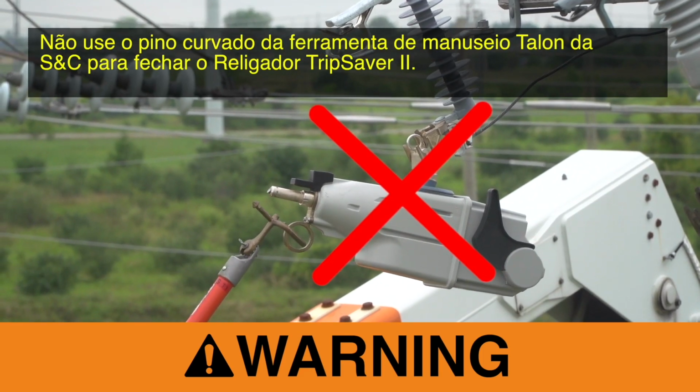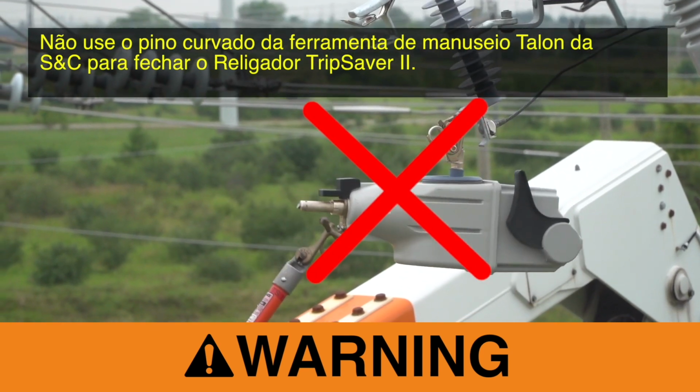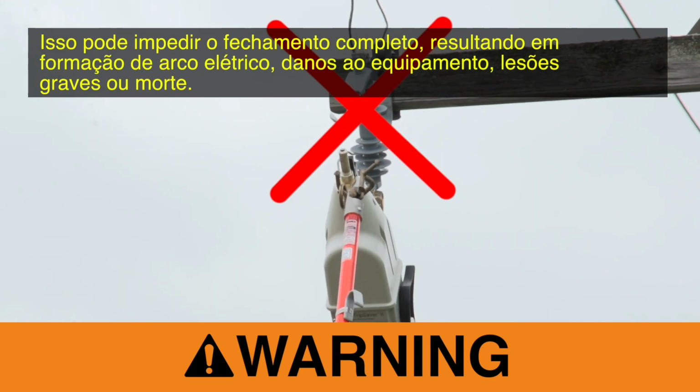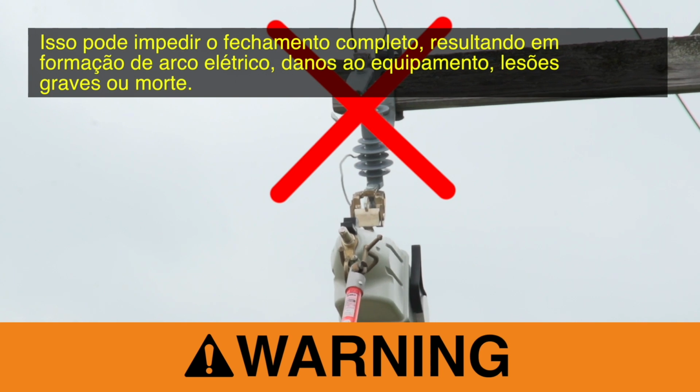Do not use the curled prong of an S&C Talon handling tool to close a TripSaver II recloser. This can prevent full closure, resulting in arcing, equipment damage, serious injury, or death.